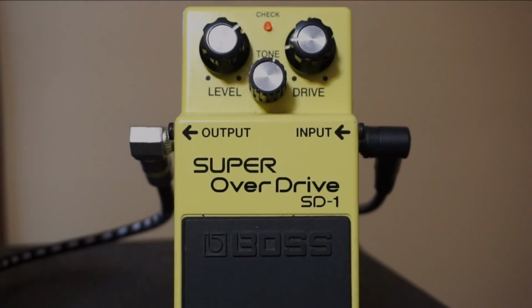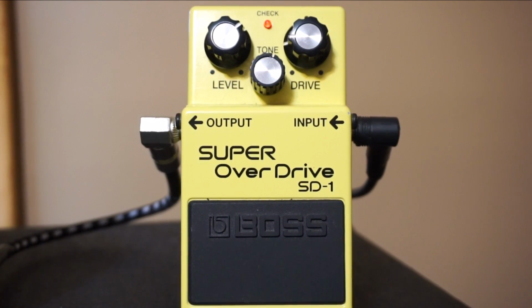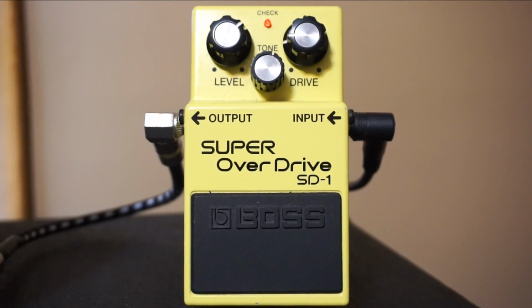The cherry on top of my rig is the Boss Super Overdrive, and this is entirely for pushing high gain sounds over the top within the Pod 2.0. Again, this doesn't have stomp box modeling. It does have a drive boost and distortion boost, but it doesn't do the same kind of EQ thing. It doesn't do the band pass around, you know, 700 to 1000 hertz like the Tube Screamer or Super Overdrive does. And I prefer the sound for this, from this for high gain sound specifically.